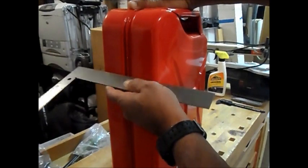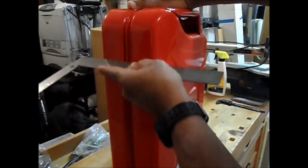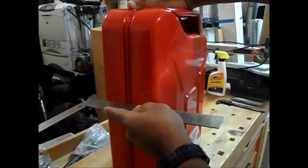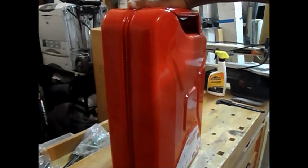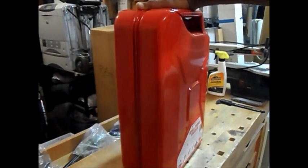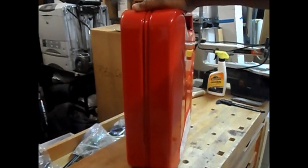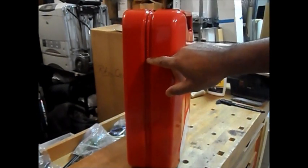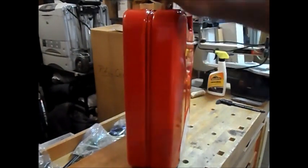See if you can hear this — I'm going to use a straight edge. Right here, hear that? What happens over time is that this thing wearing on the ground, or in the back of your car or truck, is going to wear right through that weld and gas is going to start leaking out. That's not a good thing.